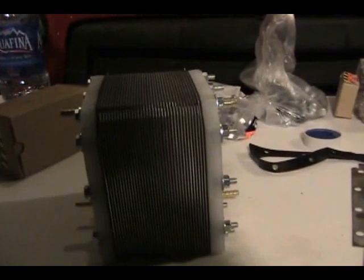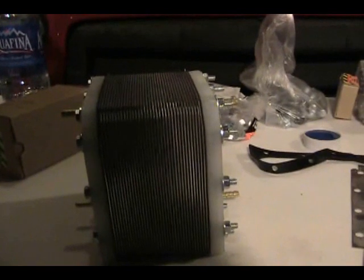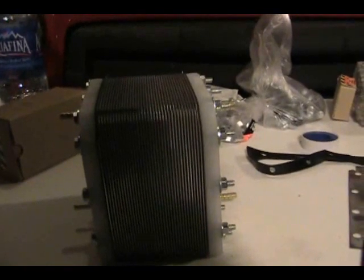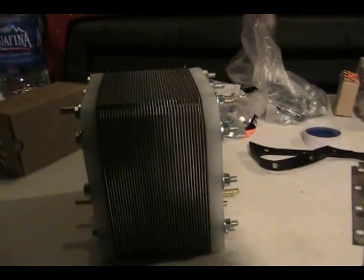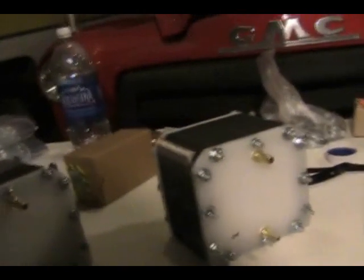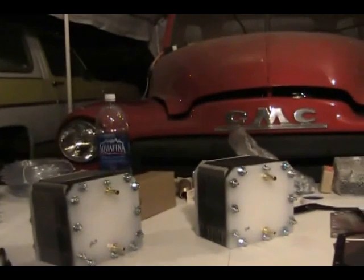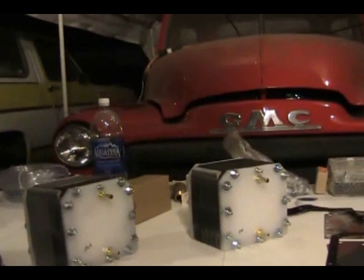There are some ideas about pumping the cells versus natural drafting. Pumping does not change the efficiency of the cell — if I were to pump fluid through the cell versus simply letting it naturally flow, the efficiency would stay the same. The MMW would stay the same — it's constant. However, your amp draw will increase, and therefore your production will increase. So you could have a cell running at 5 MMW drawing 10 amps on natural draft.